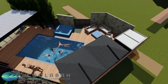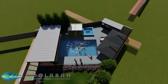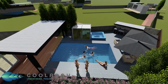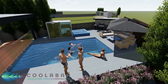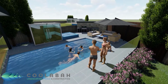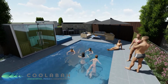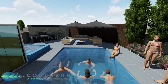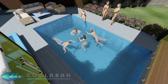Even if it's warm and raining, that's where I like the covered roofs, and I just think it has a really good atmosphere when we go and put a solid roof in, as opposed to the umbrellas. Here's the paving. Like I just said before, implications of being able to get that paving across the easement. So I'm really leaning back towards the decking because it's the lightest weight structure. It's a structure that we can demonstrate that we can span it over the pipes without damaging the pipes, and we can get our footing design done quite well.